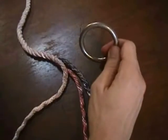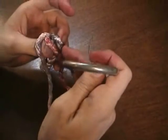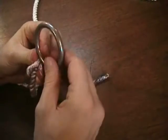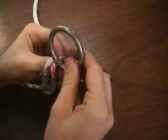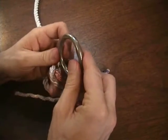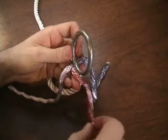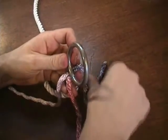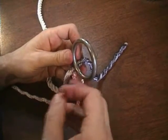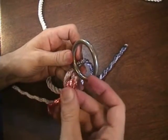The way we'll start is with two strands in front and one strand behind. We're going to be doing this exactly the same way as the back splice using a crown knot, just slightly more complex in that we're going to be going through the ring as we do this crown knot. Just as with the crown knot, each end goes over top of its neighbor and points downwards — we're just going to be passing through the ring.